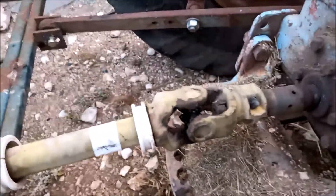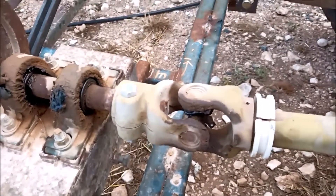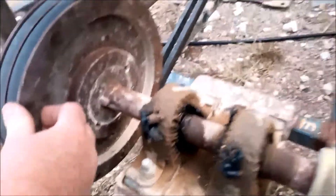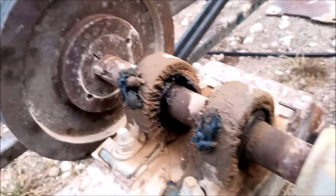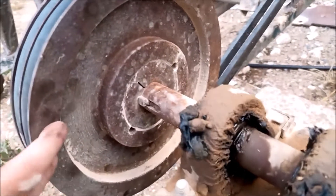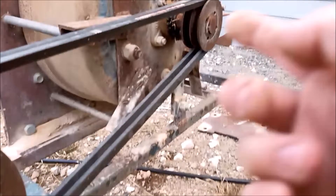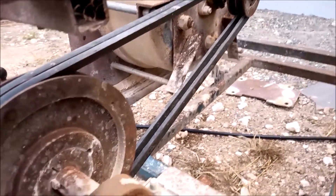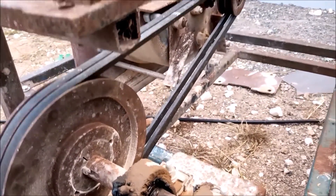Now the pulleys: this shaft is technically a 540 RPM output at the engine's rated RPM. This large pulley here is approximately double the diameter of the small one, so that gives you roughly 1080 RPM. If I was to do it again, maybe 1.5 times the size would be better — it would improve torque and it doesn't need to run that fast. I've found that running it slower makes much better material with a lot less dust.